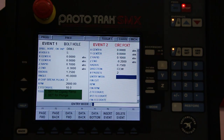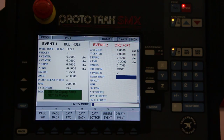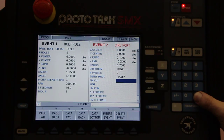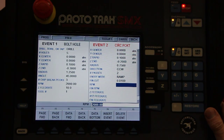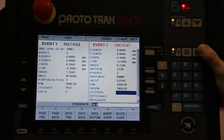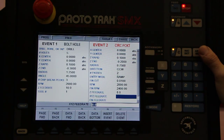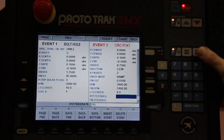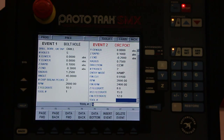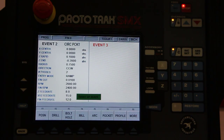The entry mode: when entering into the material with our end mill, we can zigzag ramp in or just plunge the end mill straight in. We'll zigzag it in to save the cutter and leave 10 thou for a finishing cut. RPM at 2,000; finishing RPM bumped up to 2,400. Feed rate going in at 8 inches per minute, and while actually machining around we'll go 15 inches per minute. Finishing feed rate at 12 inches per minute, using tool number 2, which will be our 1.5 inch end mill.